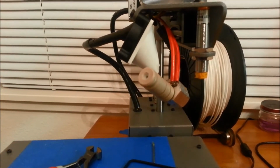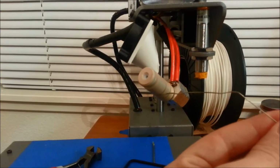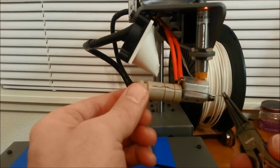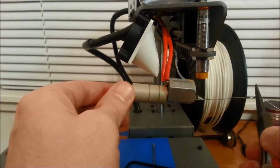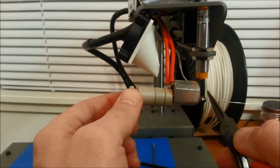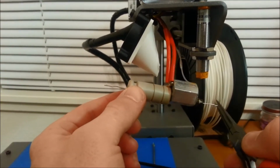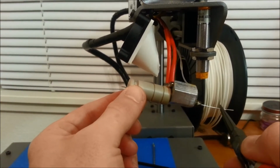Okay, so my extruder got all clogged up, and these are the steps I use to unclog it. I got this wire, like a jumper from a do-it-yourself computer board kit. Anyways, get any solid wire. The extruder's all heated up, and then I just poked it through. The first couple times, it took a little bit of pushing, but I ended up finding out I could push the wire all the way up to maybe a 1/4 inch from the very end, and I kind of just pushed back and forth.